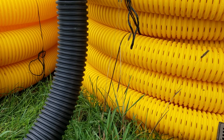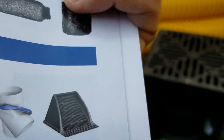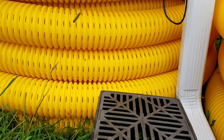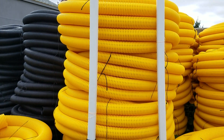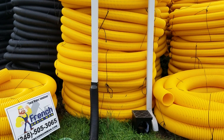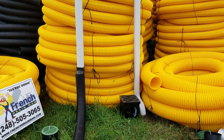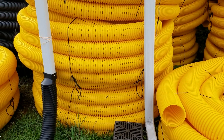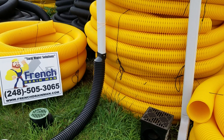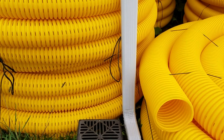They also offer a ramped, angled version supposed to reduce splash against the house — still a bad idea. When water falls and picks up speed and velocity, your downspout system is a gravity-powered system. Hydrodynamics is fluids in motion, so why would we want the water to slam into a catch basin and stop all that momentum and push? That kills the force you need to flush debris through the pipe.